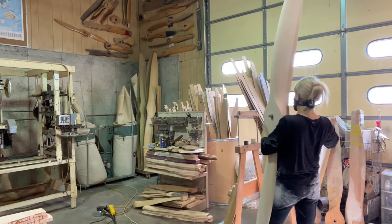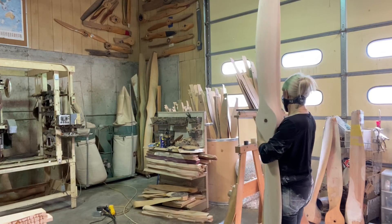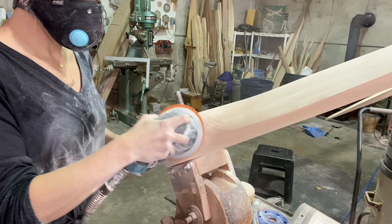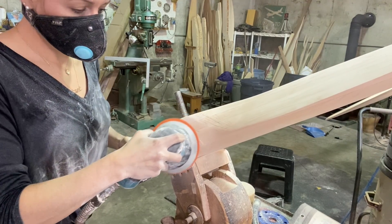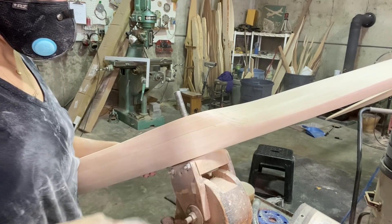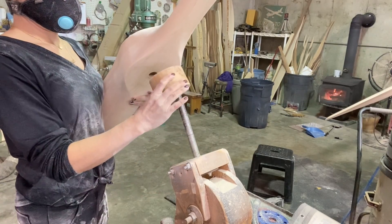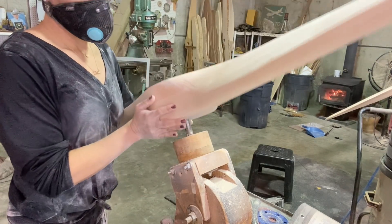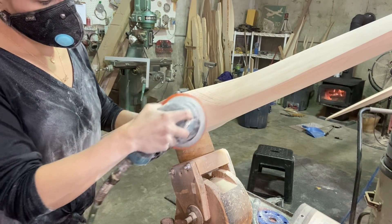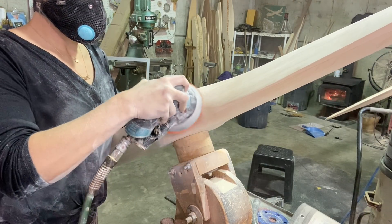It's ever so slightly off. I have a one-inch hole in the hub and the shaft on the balancer is three-quarters of an inch, so there's a little bushing I put in to make up the difference. Right here I'm sanding with the Dynabrade orbital sander — I think I have 180-grit sandpaper on it, so I'm really not taking off very much at all.